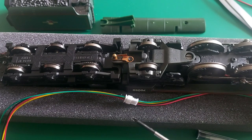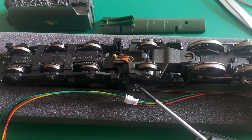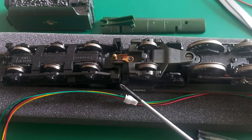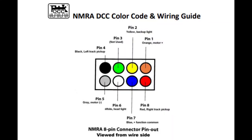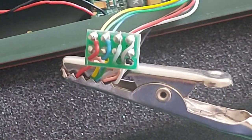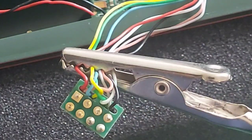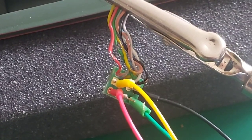The correct colours are shown in the diagram that follows. There's not much room between the locomotive and tender, and I think the best placement is to stick the connector just onto the pony truck between the body and the truck. That will mean the wires moving at least part of the right way across the joint when the locomotive is on curves. Here's the 8-pin plug with the colours arranged as in the diagram, and I can solder the wires to those connector pins. You could do this by connecting the plug all together and soldering wire to wire, but this keeps it all together. So that's the connections to the decoder soldered on with a little bit of heat shrink just to protect the join.